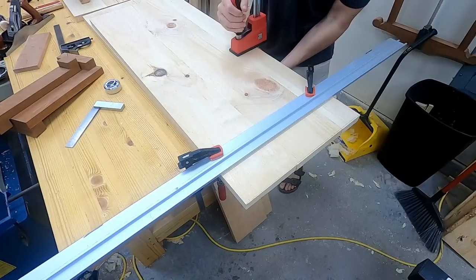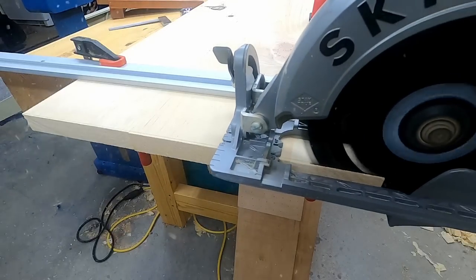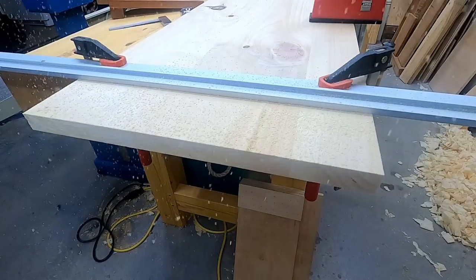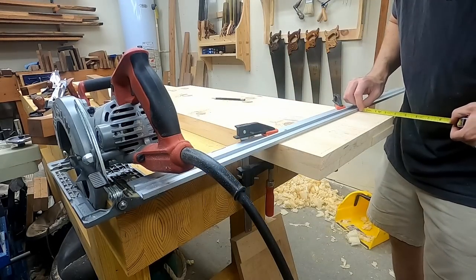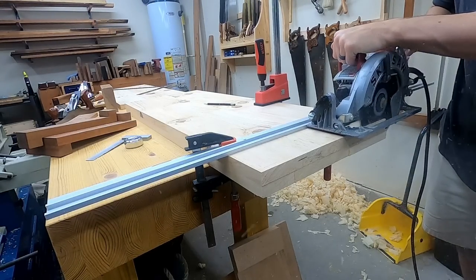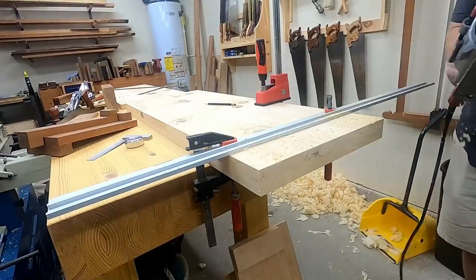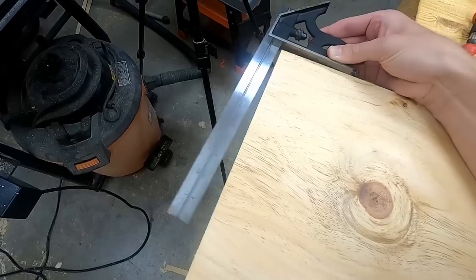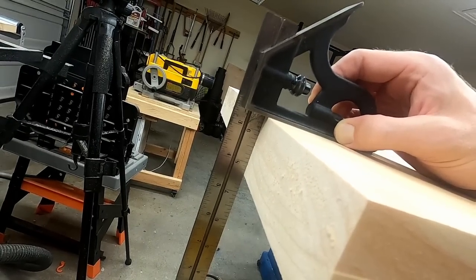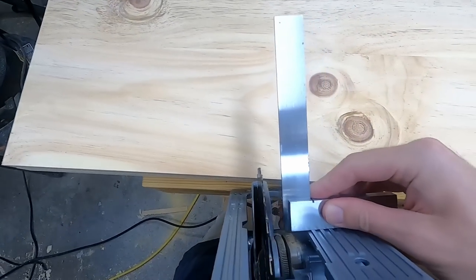It was off just a little bit so I loosen the clamp and tap it until it's just right. Then after adjusting one side, I retighten it and always recheck the other side just to make sure it didn't get thrown off. Then I clamp the whole thing down to my bench top to make sure it's very stable — not going to move around at all. The biggest perk to this first method is that when trimming the other end, I can do two at a time. If you thought that circular saws cannot be used for furniture work, then check this out — perfectly square and plumb cut. Avoid the ones with bent aluminum base plates and the battery powered ones, because if it gets stuck in the middle of the cut, you're done. This skill saw is so accurate it's sickening. It has a super rigid and straight base plate and has a blade that can be adjusted and, most importantly, hold the setting.